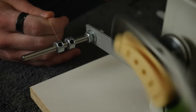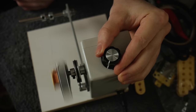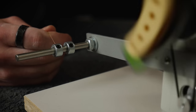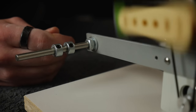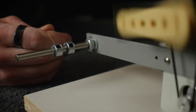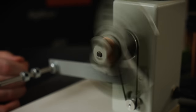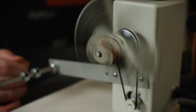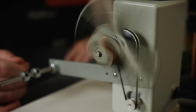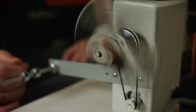Now you might think, well, perfect will sound better, right? But that's not the opinion of most players. Perfection is boring. The coils are often described as sterile or lacking in life — they work, but they are missing something to make them interesting to listen to. All the imperfections from a hand wound pickup tend to add little nuances to the way the coil interacts with itself as current flows through it. The magnetic flux of the current interacting with the other coils and the magnet across the inconsistent layers gives a more lively sound, perhaps more dynamic in its response — it's more natural, more human. These terms are all intangible and subjective, and it may just be that we are used to hearing hand wound coils. That's the way that they were done back in the 50s and 60s by teams of people on winding stations when there was very little control over replicating a coil perfectly. Each one sounded a little different to the next, and each operator's coils had a different signature. The most highly regarded and influential guitar music was made with these coils and the industry is obsessed with recapturing that vintage magic.